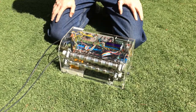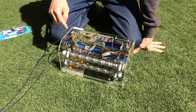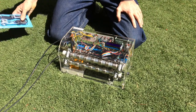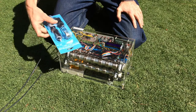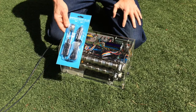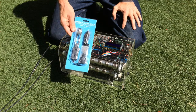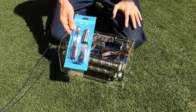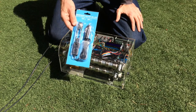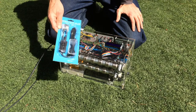The main loads are these 12-volt DC immersion coils. You can get them on eBay for under $3 from Hong Kong. They're rated at 120 watts, and since it's 12-volt DC that translates to a current handling ability of 10 amps — they should be about 1.2 ohms, though in practice they're more like 0.8 to 0.9 ohms. It's not super precise, but that's not important.